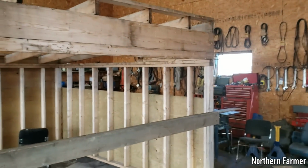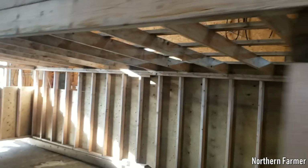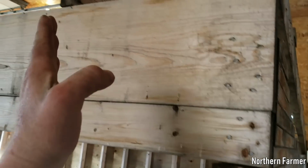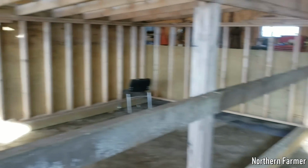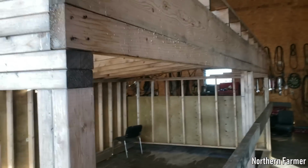What I'm working on is the front. If I can back up enough here. And I'm working on the corners here. So this corner here, we put a brace across, and we do it in all four corners. And in the middle. Put one in the middle there and the middle up there. Because the front of the shed is open, it helps keep the shed stabilized.